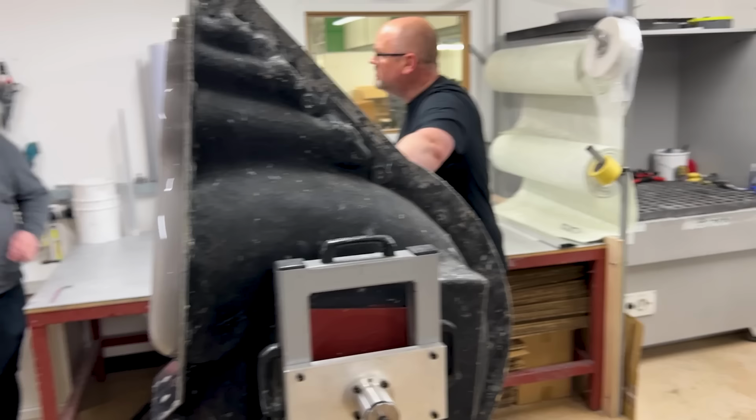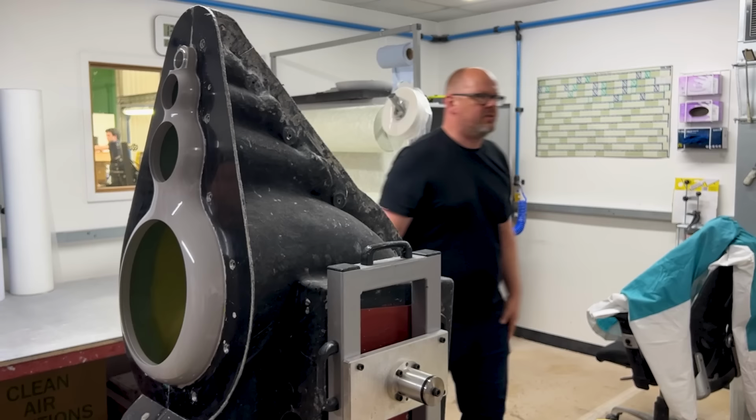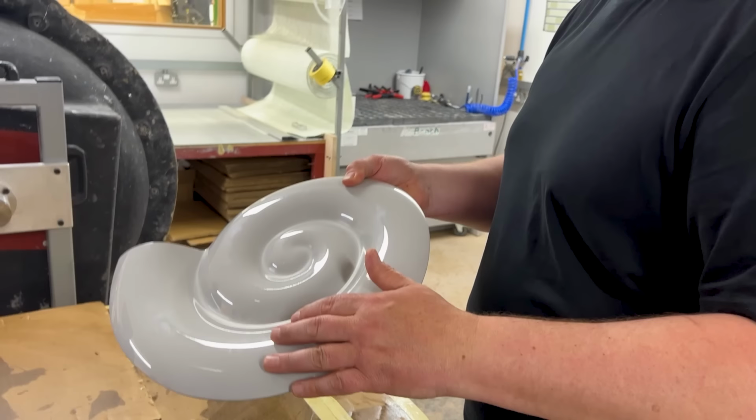So it's two molds. The molds themselves are built from the same material, plus the front section. These two sections clamshell in half. So what they'll do at the start of the week is they'll be building up each individual half section, and at the same time making the front section, the tailpipes and so forth. To give you a sense of what it's like, you can see on the inside face, relative thickness, about 6 mil from memory. That's the gel coat on the outside. The gel coat's the first part that goes on, obviously, inside the mould. That's what creates the smooth surface onto which we can paint and polish.